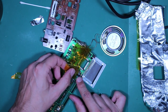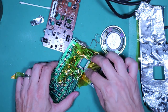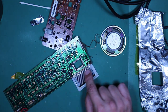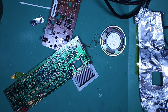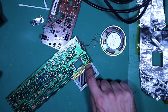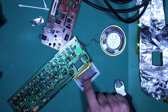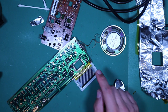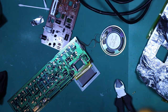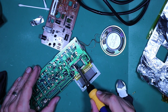Unfortunately it looks like I've lifted a track on the LCD panel with my Kapton tape. I put some tape on in the hope that it rescues the display — it felt like maybe it was just the plastic that came away and the conductor was intact. I'm hoping that's the case. In the meantime I'm going to come in with my soldering iron and smooth out some of the pads where the old chip was so the new chip sits neatly in place.